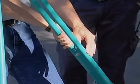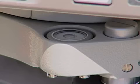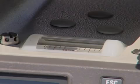To level the instrument, you manipulate the slides of the legs. You don't actually move the legs, you just slide the members up and around. When you've got the circular bubble level, then you can go to the next bubble, which is the plate level. That's the one that's a little bit higher, closer to the telescope.